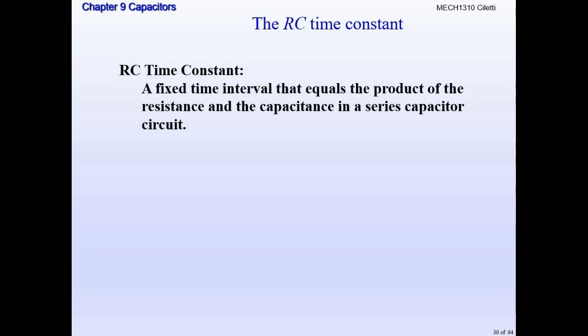All right, so earlier when I was talking about your car and using a capacitor in there so that your battery didn't lose all the power and your lights dim when you get that big bass going on from your woofer and amp and all that sort of thing. Well, what really impacts the charge and discharge of the capacitor is called the time constant, RC. What RC stands for is resistor and capacitor.